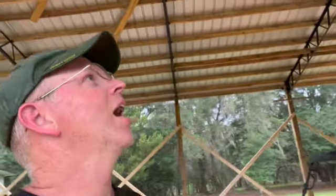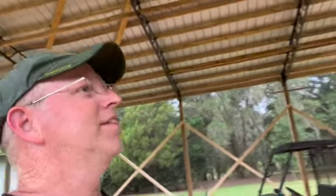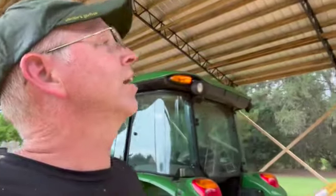The other reason this is actually really good, or fortuitous, one might say, is because I'm supposed to keep an eye on the roof because every once in a while when they put in one of the screws, it missed the purlin. So you get a hole. So they seal that. They just put caulking. They said, hey, just be out here, take a look, find if it's dripping anywhere, and then it's just the kind of thing we just got to patch up. And the guy will come over and we'll do it together. But I honestly, so far, I'm seeing nothing. So it's a very good sign.